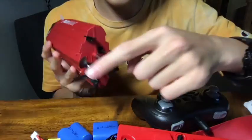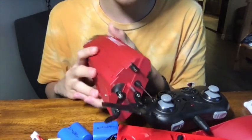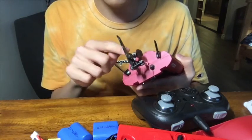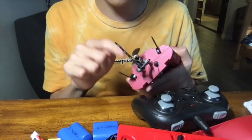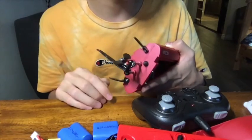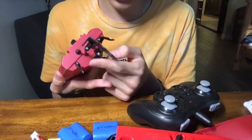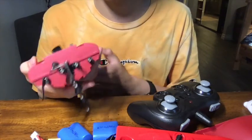As you can see, boat propellers are pretty different compared to airplane propellers. They're much shorter, but they're also wider. They're kind of leaf shaped. That's because water has a much higher density than air, so you need something with more grab, and water has a much higher viscosity as well, so you don't really want long blades because you might overwork the engine or the motor. So that's why these propellers are much smaller and much thicker compared to airplane propellers.